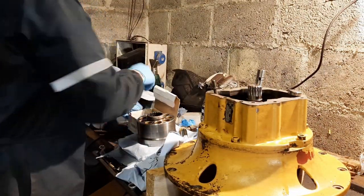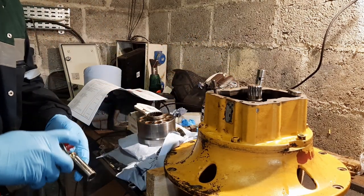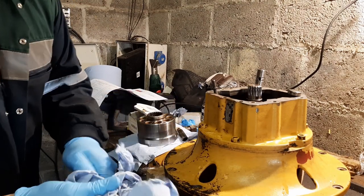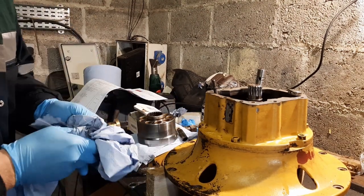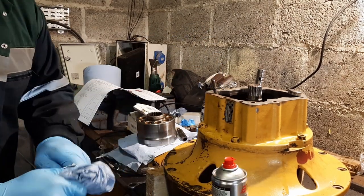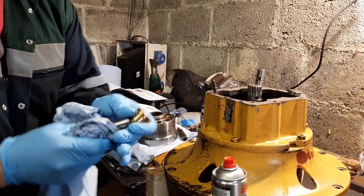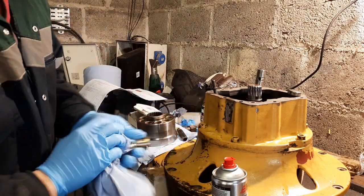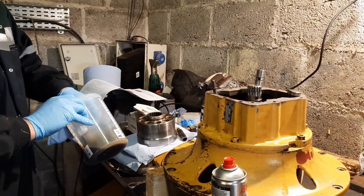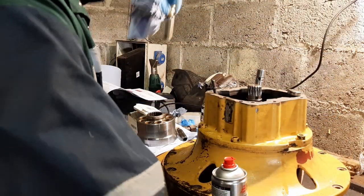So, clean pistons, oil them, and fit them in the bores. Pretty much all these parts came with protective coating on them. Need to make sure I remove as much as possible, especially off the part that sits inside the bore, and from any of the oil galleries. So that's the first piston. I did that with some hydraulic oil, and slot it in.